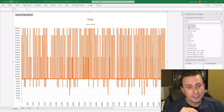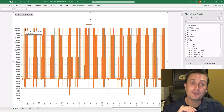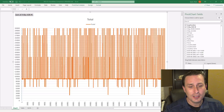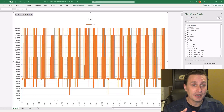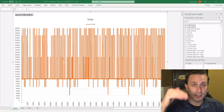This is where we used to be — the FRSky XSRM. The frames jump anywhere from 9 milliseconds down to 2 milliseconds, but all the way up to 30 milliseconds. Very inconsistent. Some people say that could just be dropped frames. We're only looking at 50,000 samples; at 8 kHz that's only 6 seconds of flight. All the data we're looking at here is the first 6 seconds of a flight, so you can see how many frames and how they jump all over the place.